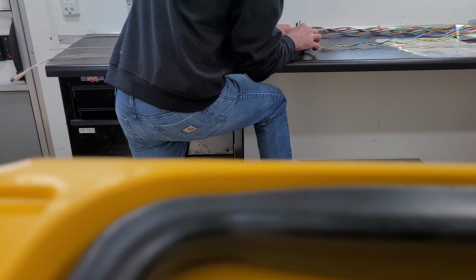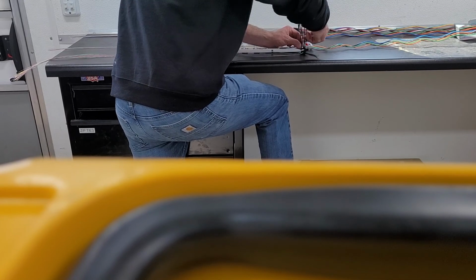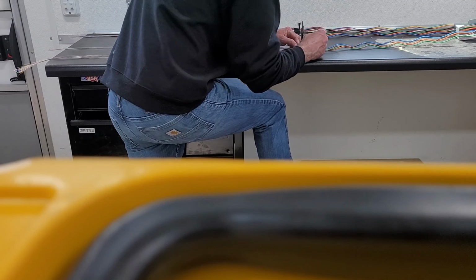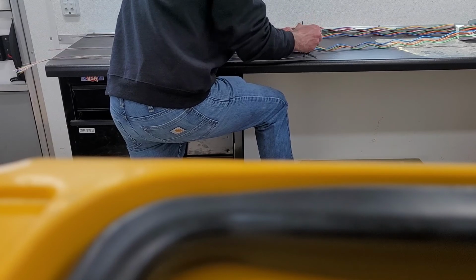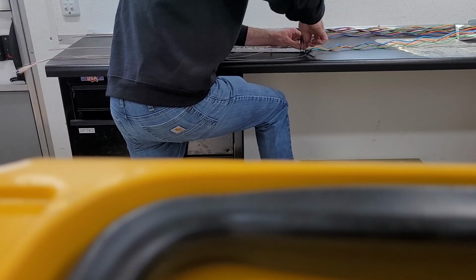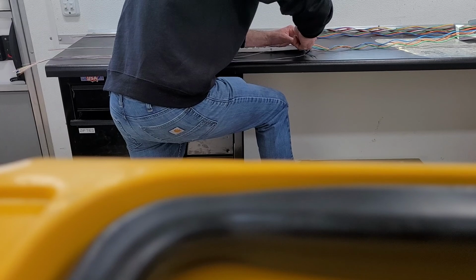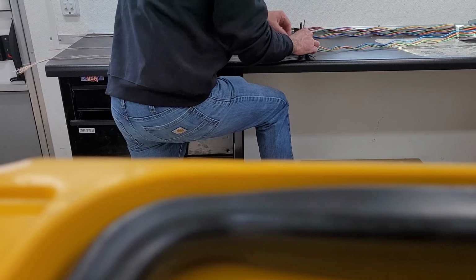It's very easy to cross zip ties doing this, by the way. So, I mean, if you have limited zip ties, be careful. And the closures themselves come with zip ties, but only enough for the amount of trays that came with the closure, and usually only one zip tie or two, which you need two. It's kind of ridiculous, if you ask me. Why would you send one when it's one per... Just get yourself a 100 pack and keep it in your splice gear.